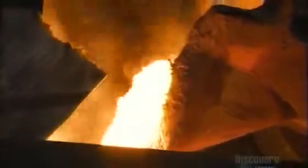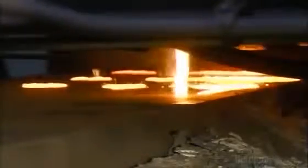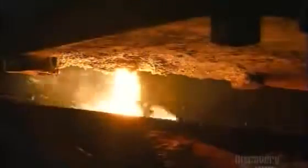To cast the hydrants, workers first make two-part molds by compressing a mixture of sand and bonding materials. One part, called the mold, forms the hydrant's exterior shape, while the other part, called the core, forms the interior shape. An automatic core setter positions a core in each mold, then a conveyor advances the mold under the pouring box, which fills the cavity between the mold and core with molten iron.